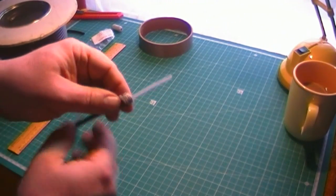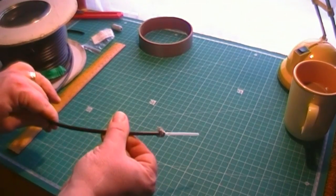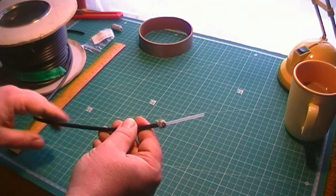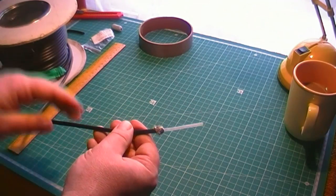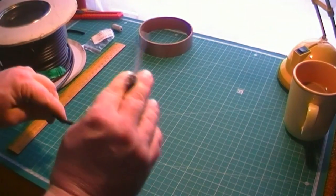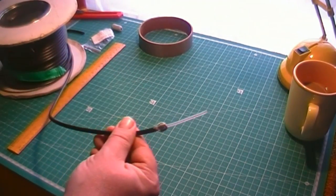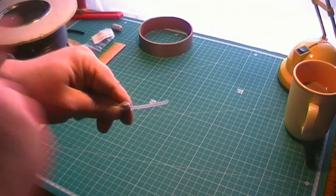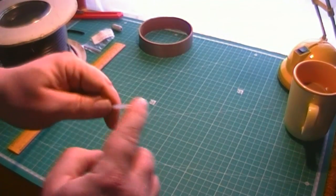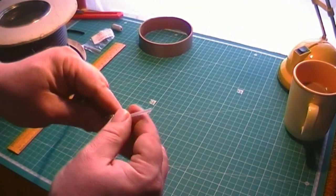So indeed it's stranded for maximum flexibility in my sort of multi-deployment type environments. You can get away with solid conductor, but let's say for my sort of multi-deployment things where I'm rolling the thing up a couple of times a week and I'm rolling it, etc, etc, various temperatures, stranded seems to last. Solid conductor, no problem at all for fixed install, but in my case I use stranded. I have used solid and it worked.